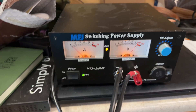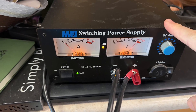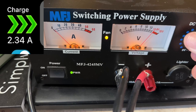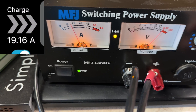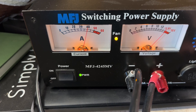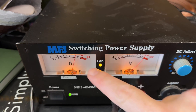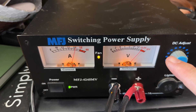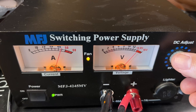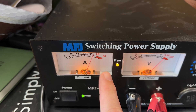All that to say that it will charge to full capacity at some point if I leave it this way, but the reason I bought this power supply to begin with is because I can turn up the voltage so that the current also drives harder, so that I can charge this thing at a reasonable rate instead of in, you know, a week — maybe a day. Part of the deal is that I have to keep track of the draw on the power supply and on the BMS as it's charging, and once it hits that balance point I need to turn up the voltage so that the current is able to push into those cells.